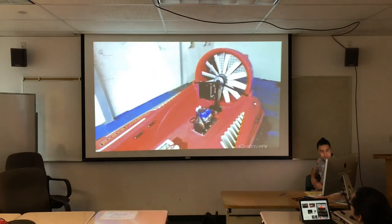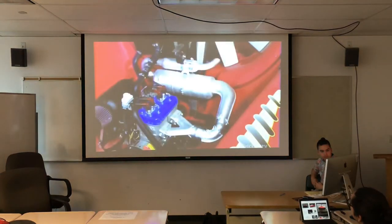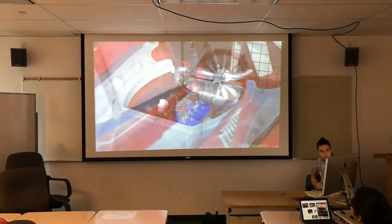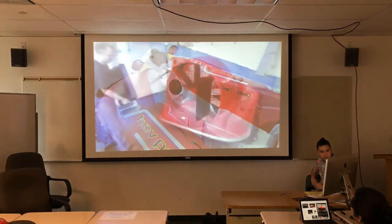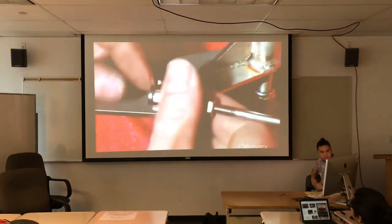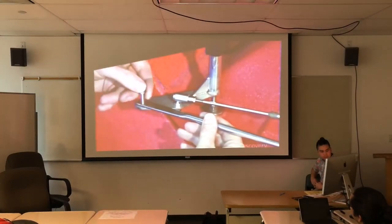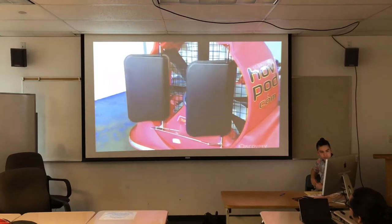The engine can be either a two-stroke or four-stroke depending on the amount of power desired. They connect it to the drive assembly and protect that connection with metal casing. Once the engine has been bolted into place, they equip it with a radiator, an air filter, an exhaust system, and a waterproof box containing the electrical components. They connect the fuel tank to the engine and cover the engine with a polyethylene hood to keep it dry. They install seating including a rear bench that accommodates three, then attach two rudders to the fan duct and link them with a bar so they move in tandem. These steering parts are made of marine-grade steel to prevent rusting, and a quick check confirms the rudders are operational.